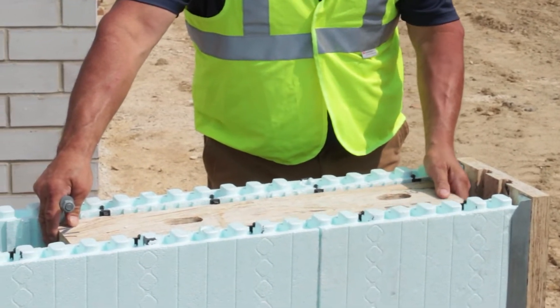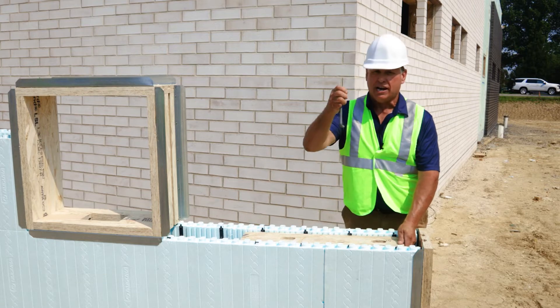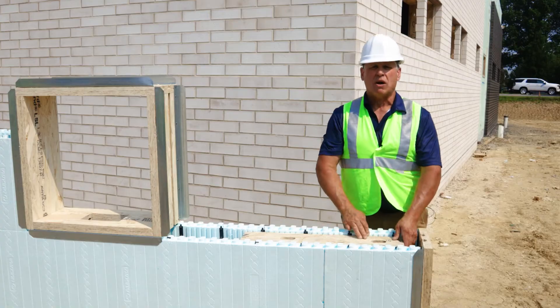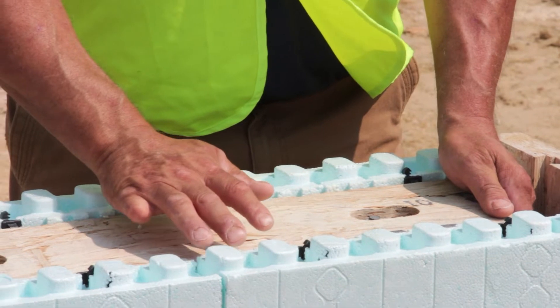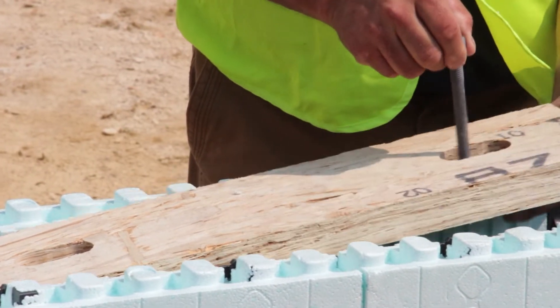Like this, to straighten the wall, you push it into the wet concrete, take your j-bolt, and drop your j-bolt in. Tomorrow you're setting your trusses or your floor joists. This sill plate was designed to go inside of the ICF. We also have a secondary one that is designed to bridge across.